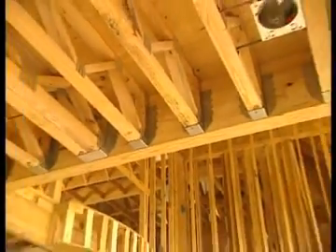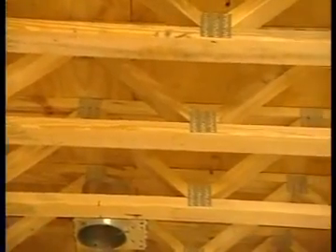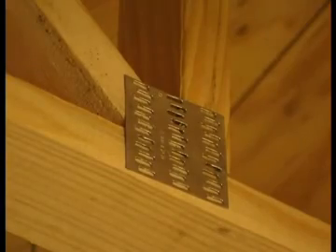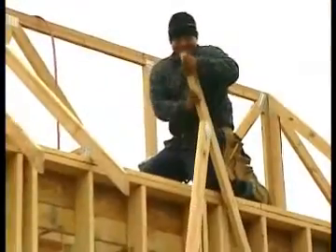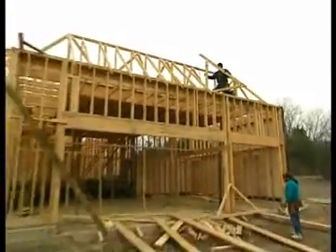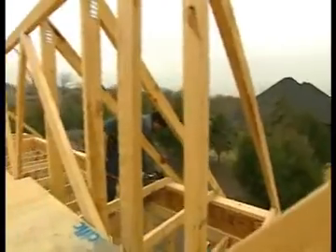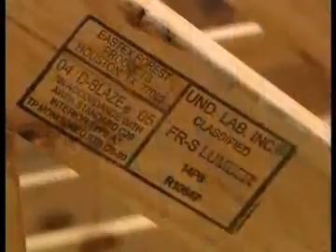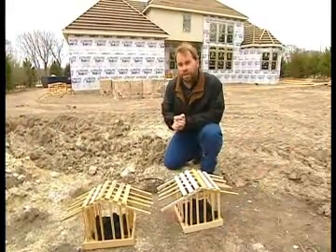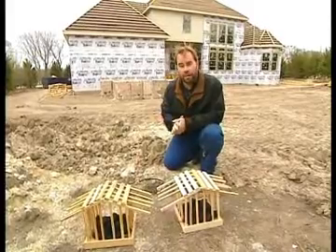Southern Yellow Pine allows us that flexibility, and because it is such a dense softwood, it really helps in the holding value of the steel gusset plates, which are essential in assembling our trusses. To support the roof of our project house, we're using a combination of roof trusses and rafters. All of the rafters and trusses in our project house have been treated with a fire retardant. We want as much escape time as possible in case the house ever catches on fire, plus give the fire department as much time as possible to get in and save the house.